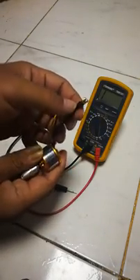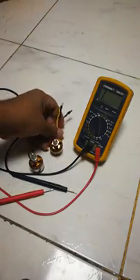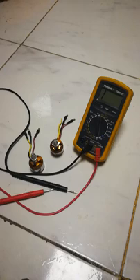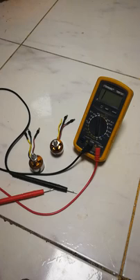On this motor I have a problem with the black cable — I'll have to strip it apart and resolder it. Overall, this is how you check motors if they're twitching. The motors are good. I thought they were bad and was going to buy new ones, but the problem was only the connectors. This is how you check motors via continuity using a multimeter. Thank you.